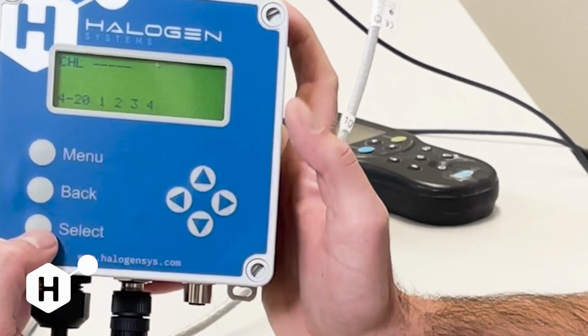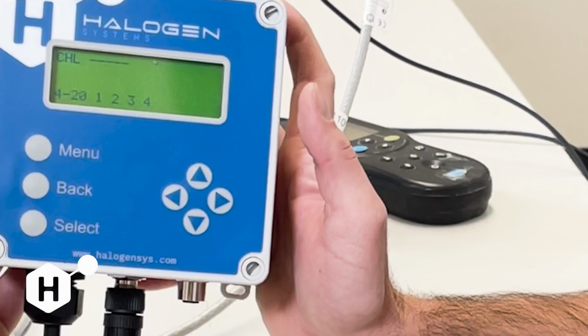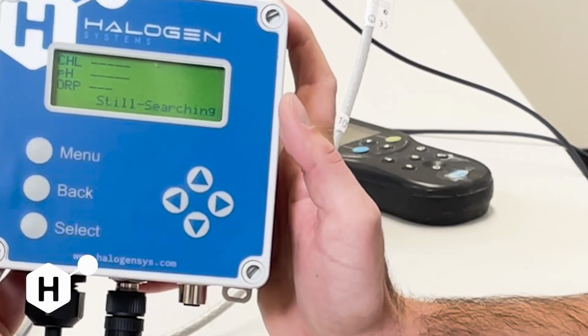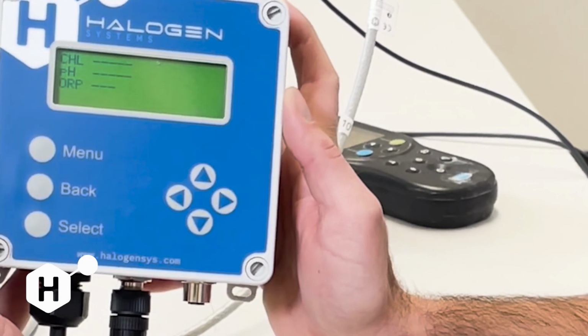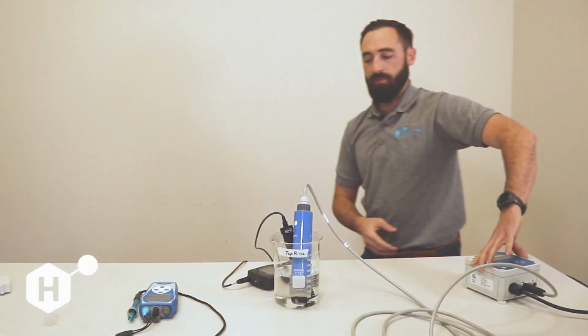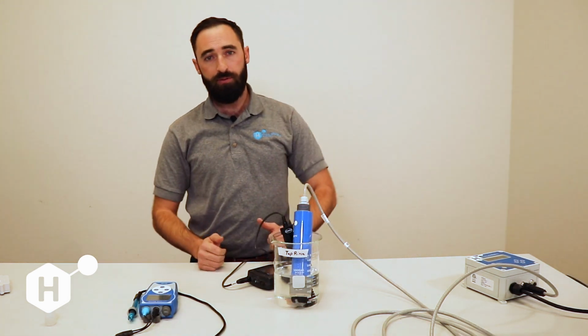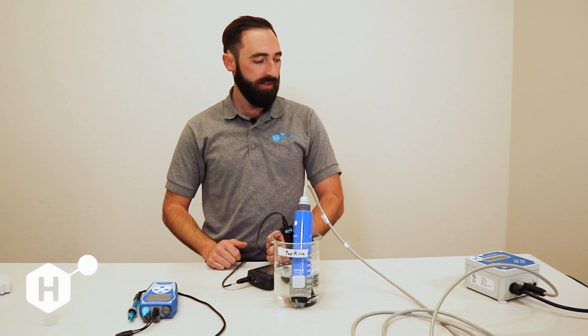This is a good way to clear errors or if anything else is going on that is causing your sensor to run non-optimally. Go ahead and hit Cal Defaults as one of your first troubleshooting steps. That is reference calibrations for pH, temperature, and conductivity, as well as how to revert our calibrations back to factory stored defaults.